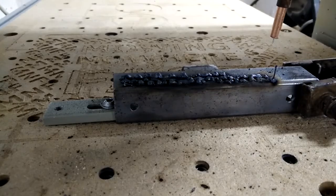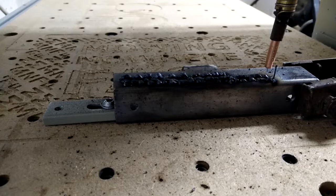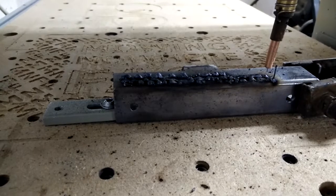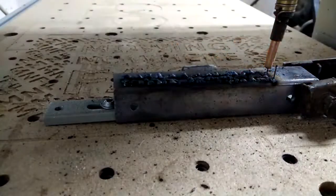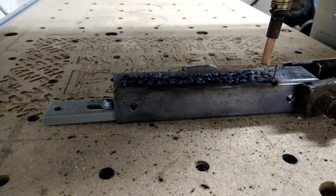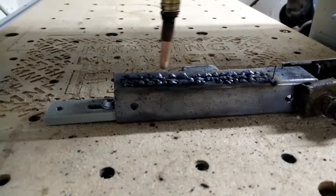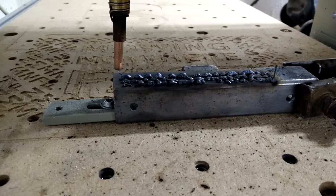Time for a new tip. I'm not going to try it as low as 2mm away because the height of the bead looks like it's more than 2mm, which is presumably what caused the problem. I'll put it back to the original height and maybe we'll slow down the travel speed — put it back down to 200. Maybe the temperature's too cold, so let's put it up to 4 on the power setting.